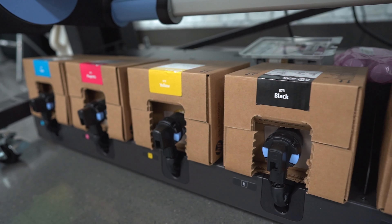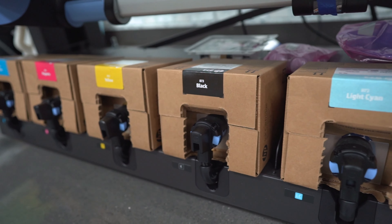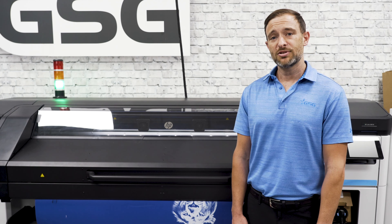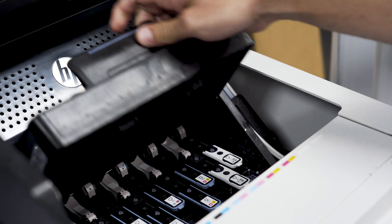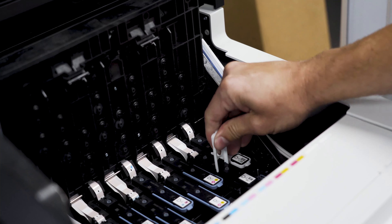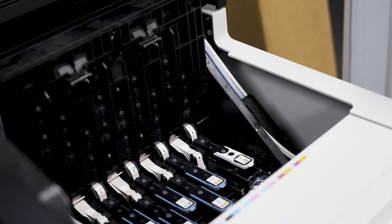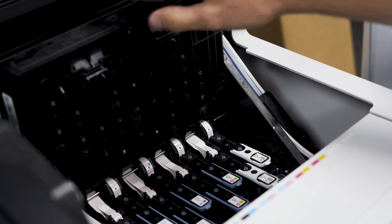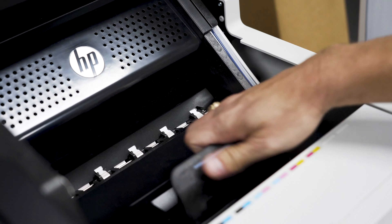The key difference between a 700 and 800 printer is the bulk ink system. This allows for a lowered price per square foot for some higher volume users. The other additional option is the white ink. The white ink option consists of a rotation chamber as well as new printheads and white ink. The rotation chamber allows you to remove white printheads from the system, replacing them with dummy cartridges. This closed loop system allows you to save money on wasted ink.